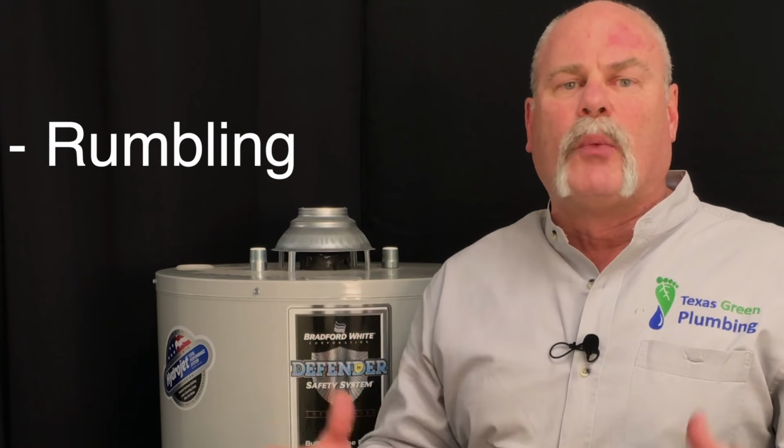The other noise you get with an electric or a gas water heater can be a rumbling noise. And that can be caused by the calcium and magnesium, all the sediment being built up in the bottom, and then that water flushing it around and creating a lot of noise while this is going on. So there's a couple of things you may want to think about here.